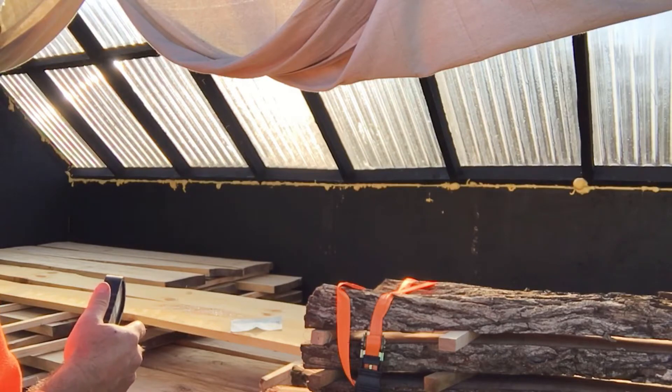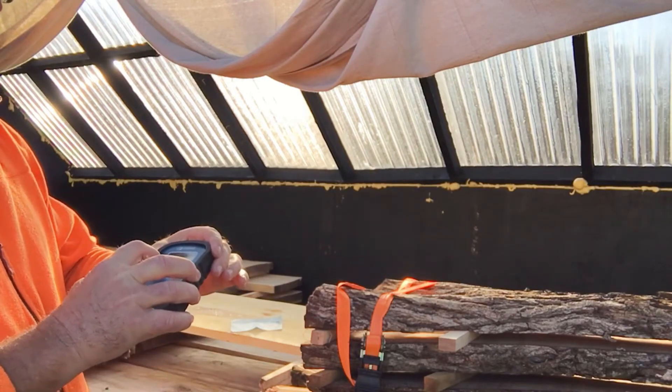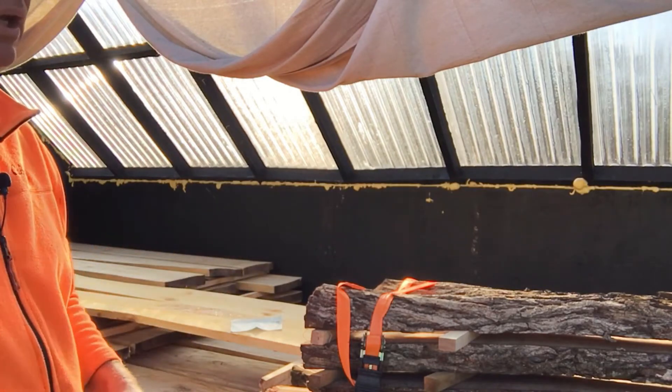What they say is for every inch of thickness, air drying takes about 12 months. So I could certainly leave these in here — maybe that's what I'll do. Come back in about a month and check.